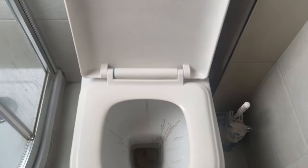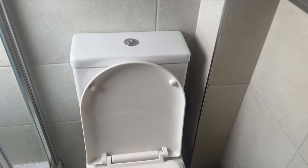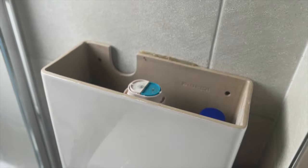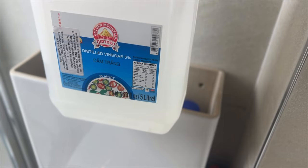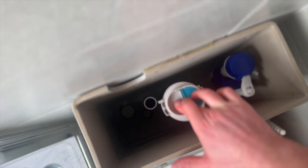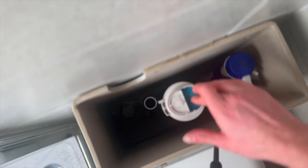I'm going to show you my favorite way to use the vinegar, which is inside the toilet tank. I'm taking the lid off so I can pour the vinegar into the cistern itself, where I'm going to leave it to dwell for about an hour before flushing it through the system, softening all of those hard water deposits so I'm able to scrub them off.